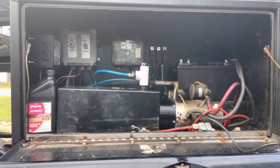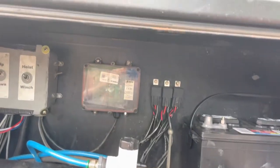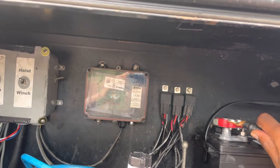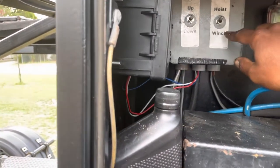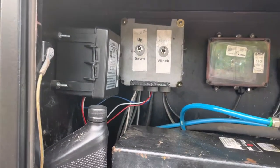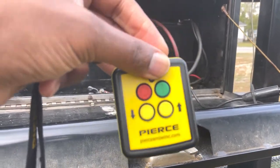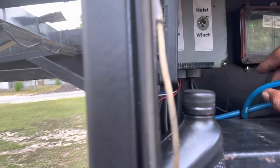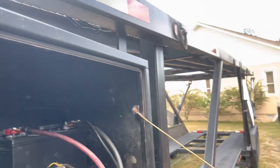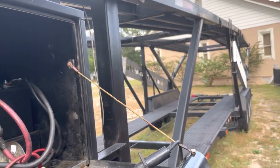I'm gonna start with the control station for the winch and the hydraulic liftgate. It's a brand new battery on this rig. To turn on the hydraulic liftgate, just put this cable on your battery. Come over here to your control — you have a hoist and a winch. The hoist is for your hydraulic liftgate. The remote doesn't work, but you can purchase one for about $100 online. To operate the liftgate, just go up and down. The liftgate is going down now.